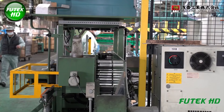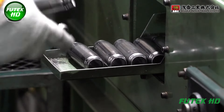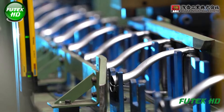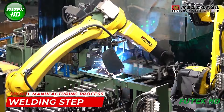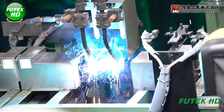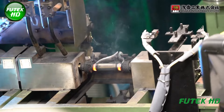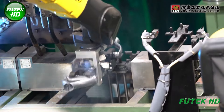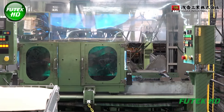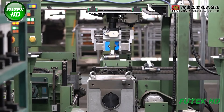This part is essential for providing a strong and secure connection between the shovel's head and handle. During the welding step, the shovel head and handle are carefully joined together to form a strong, unified structure. The most common area for welding is where the shovel head's socket, or collar, meets the handle, ensuring a secure attachment. The welding process involves using arc welding or MIG welding techniques, creating strong, durable joints that prevent separation under stress.